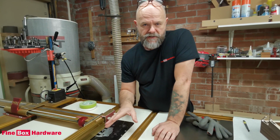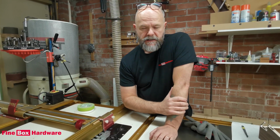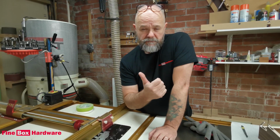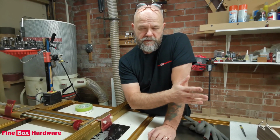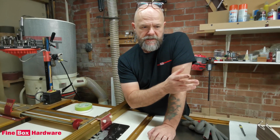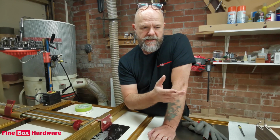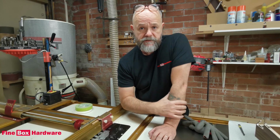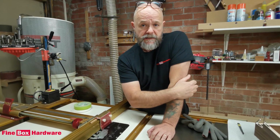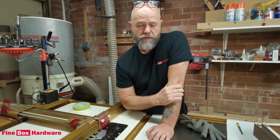And I should have mentioned at the start, you really want to have quite a sharp cutter. A new cutter produces so many boxes and then it's made redundant and then another cutter. Now that cutter's not for the bin, but if it gets resharpened, it obviously just makes it smaller. So what I tend to do with my old cutters is I get them resized into different cutters, for instance maybe a 6mm cutter for producing slots and stuff like that, because spiral bits are quite expensive.